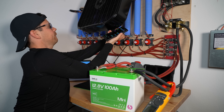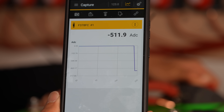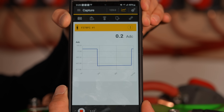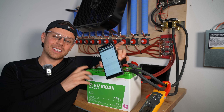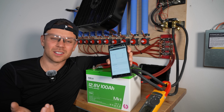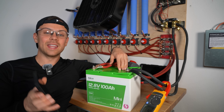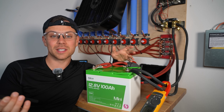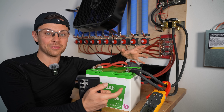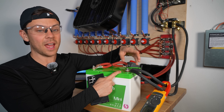That was almost a whole minute at high current. I remember this company — the last one I reviewed from them had a massive surge capacity, and this one has the same BMS, but it doesn't really have overcurrent protection. Previously on the last battery from them, if you do this test over and over, it will overheat the BMS and disconnect sooner and sooner each time. That protects the battery, but it doesn't protect anything connected to it. If you have a small wire and get a dead short with no fuse, it will melt and can possibly cause a fire. You need a fuse with these.